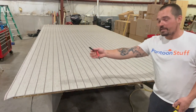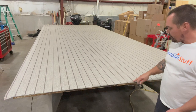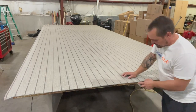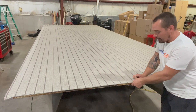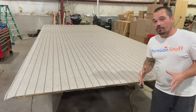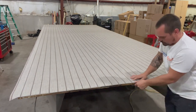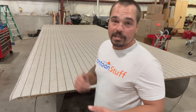Now I'm going to go to the back and, measuring from the same starboard side, measure in 47 inches. I'll pick this line to line up with my 47-inch mark. I'm going to do my best to get this line lined up with that mark on my plywood on the front and the back. Then I'll clamp the front and pull everything snug and tight to the back, make sure it's still lined up, and that will make all my lines nice and uniform and straight. I've got that front lined up — putting a clamp on to hold it in place.